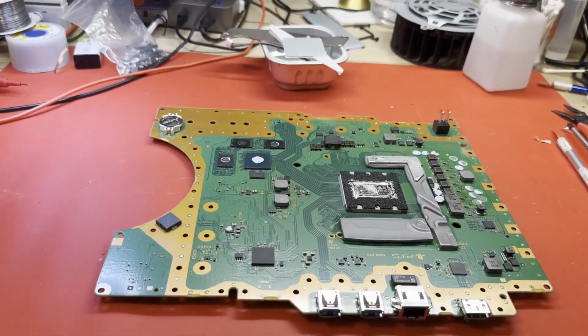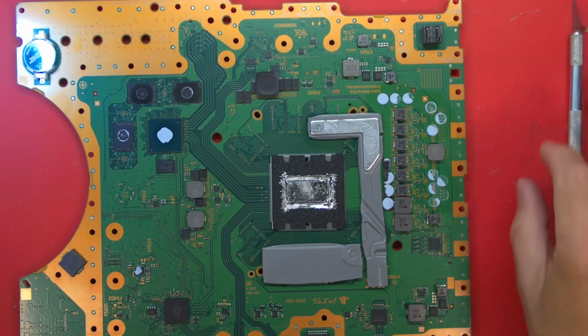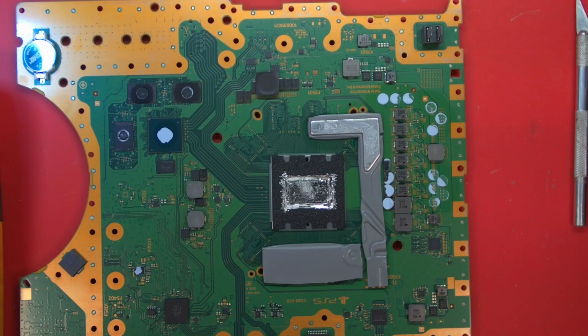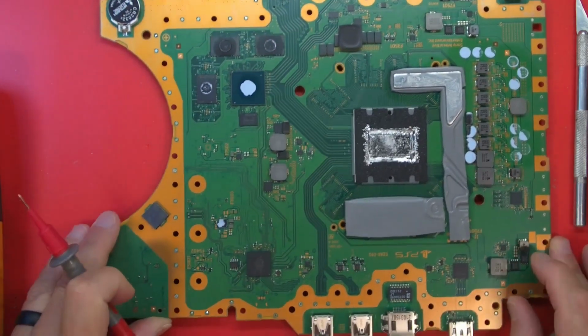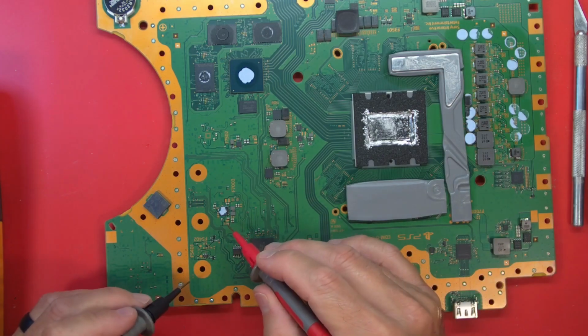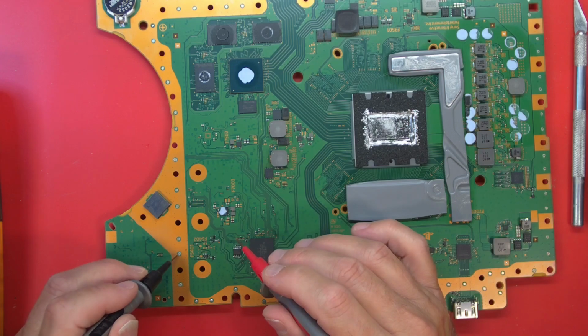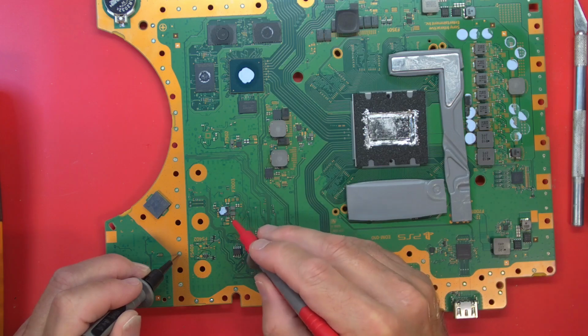Well, let's take a look at this circuit board. See if we can find anything obvious with our meter. I'm hoping something jumps out at us. Continuity mode is your friend. Let me check right around this IC right here, which is either a DA9065 or whatever the other one was, a Richtek one. It's either a Dialog or a Richtek, I can't remember. I haven't looked yet, I should say.